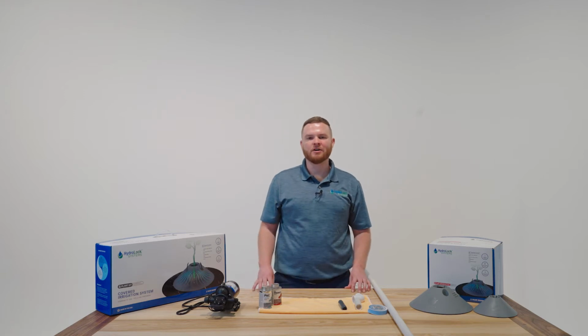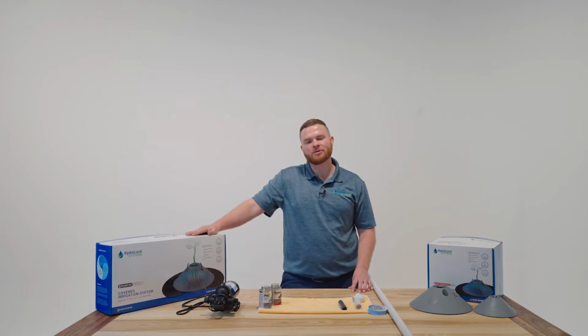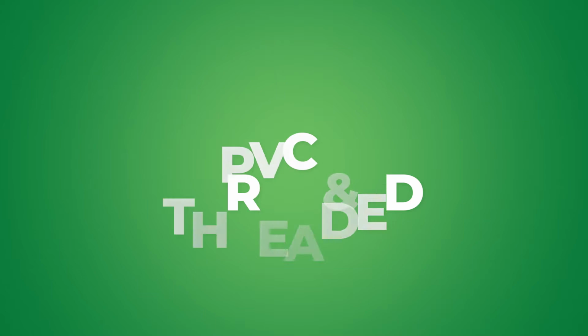In this segment, we're going to go over PVC basics and threaded connections. Every HydroLock system utilizes 3/4 inch Schedule 40 PVC and a series of threaded connections. It's highly important that you do all these processes perfectly for a leak-free, long-lasting system.